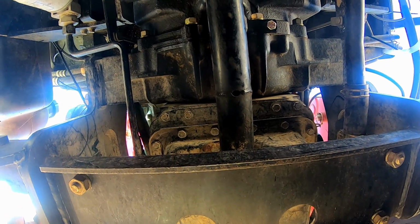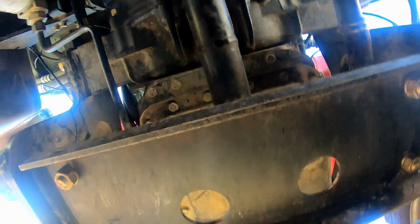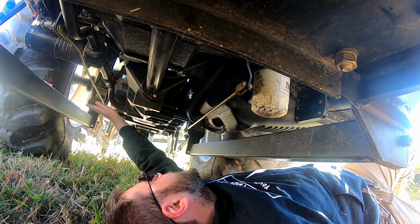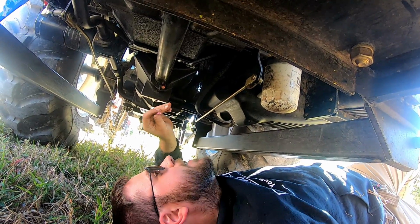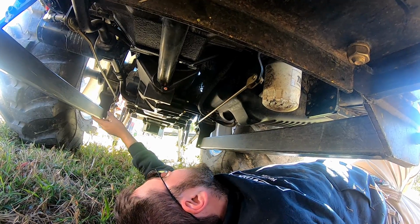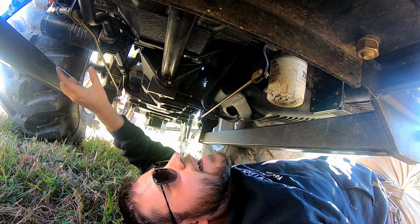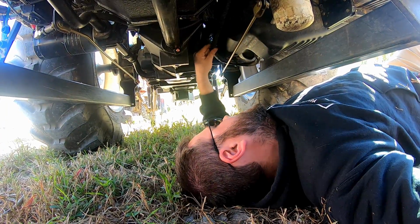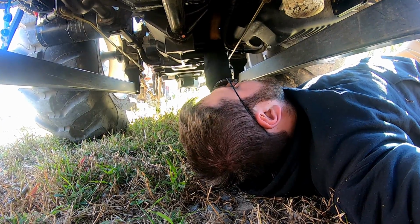One of the next things I want to try to do is a skid plate, and I want to cover basically almost all of this, because of this linkage right here. Oh, hey look, I found my fifth one. But anyways, I think I'm going to end up doing a skid plate that bolts onto these rails for the loader support. It'll protect the hose, the linkage, the filter linkage, the wire, this hose right here. Just try to really cover everything.